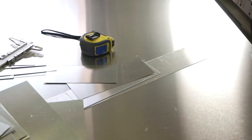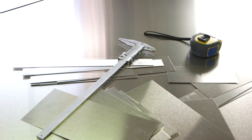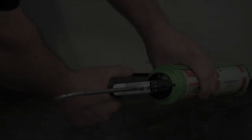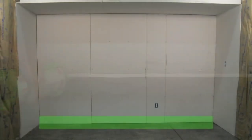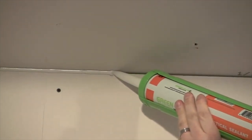Here are a few more tips on installing staggered or double stud walls. No matter what option a person ultimately decides on, there are some additional tips to keep in mind. The air cavity created should always have loose insulation filling, which will help with sound absorption. If there is trouble with any gaps when the floor and ceiling meets up with drywall, use acoustic caulk to help as much as possible. Getting caulk specifically for acoustics helps out more than it might seem.